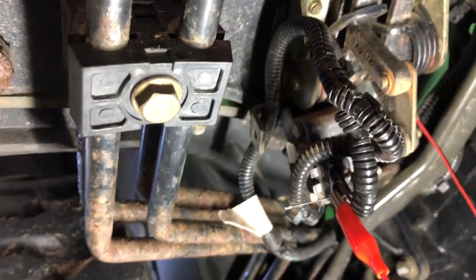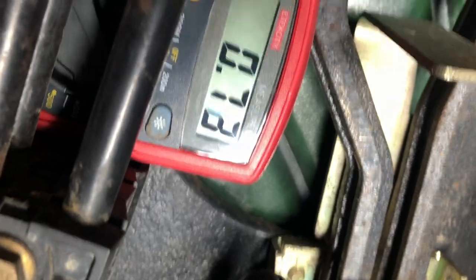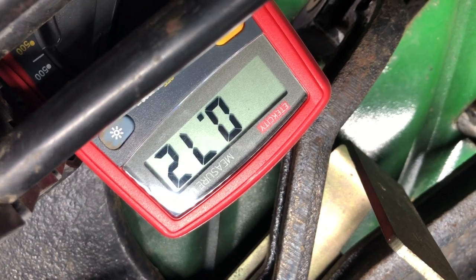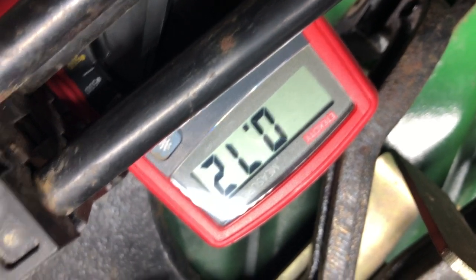You can do this other ways — stick the alligator clip or meter probes right in there — but I don't like to do that because it's hard to know if you've got a good connection. I've got the meter hooked up to the purple wire on this sensor, which is the back-feed wire to the controller. This should be between 0.5 and 4.5 volts. With the ignition on, I have 0.7 volts. The controller software will say: if it's less than 1 volt, it's not being pressed. Right now the reverse pedal is not being pressed, and I'm less than 1 volt — so far the variable sensor looks like it's doing its job.